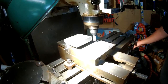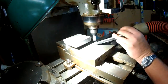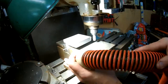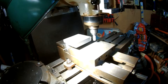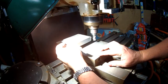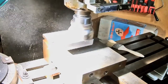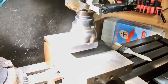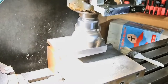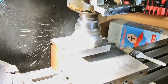We're doing the same operation on one of the other edges. I've flipped the part around, put the milled surface against the fixed jaw, and I'm still using the aluminum bolster bar wire. So I've got those two edges parallel - the previously faced edge and this new edge in front. Now I'm facing the top of that. The lighting is really blown out here - I had the spotlight a little too close for the camera. Chips are coming off well, the cutter's doing really well.